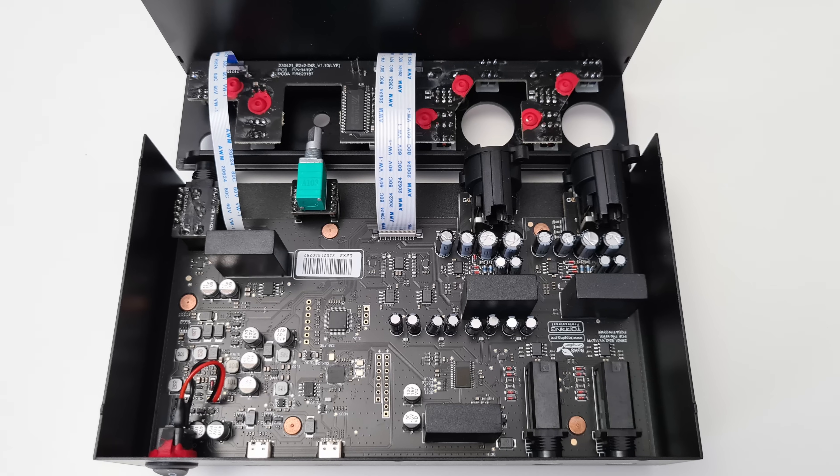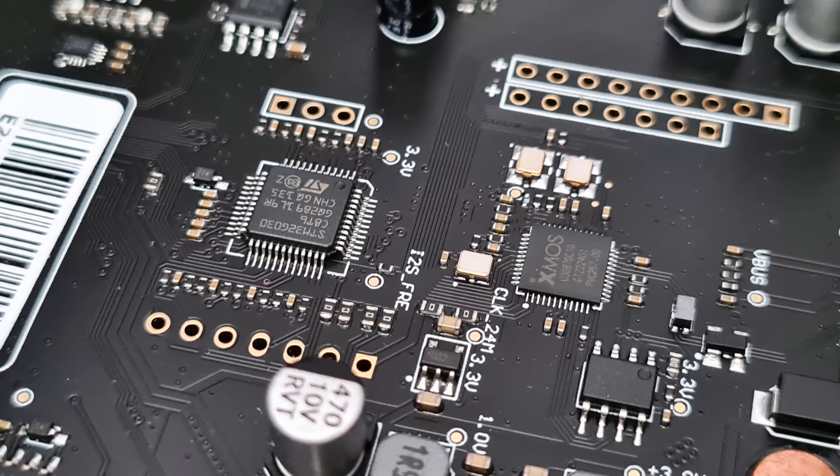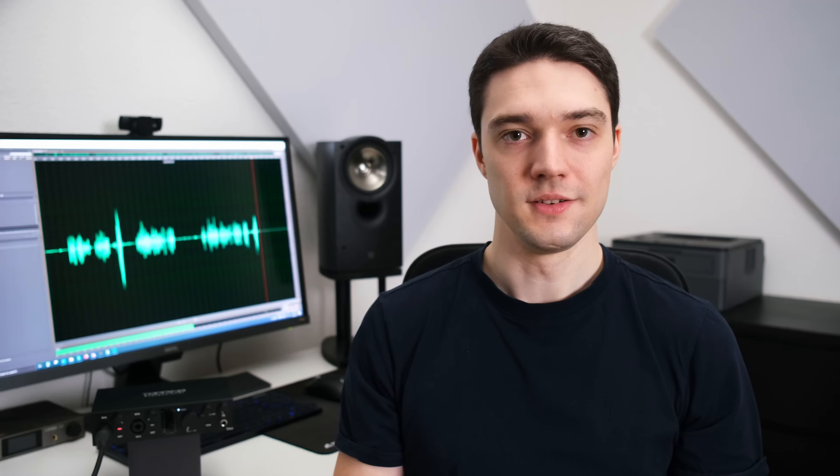I couldn't help myself and took apart the interface. The analog-to-digital and digital-to-analog conversion is all done by one mystery chip — the label has been lasered off. Not quite sure what Topping is hiding here, and we can't be certain of the exact chip, but if I had to guess I would say it's an AKM AK4621 codec. I say this because its performance pretty much matches all the measured performance and number of inputs and outputs. That said, the only thing that counts is the audio quality as a whole, which we will definitely look at later in the video.